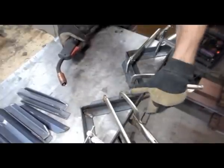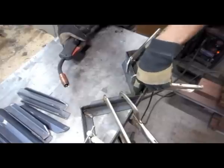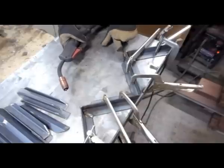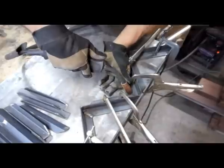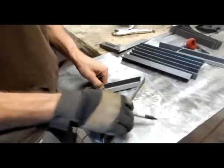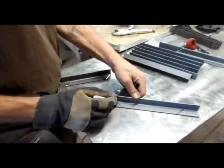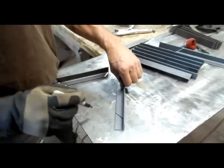I've set up a quick change-out 90-degree so I can do this one corner and then I'll have the measurement for my third leg of the shelf bracket. What I'm going to do is weld this corner and all of them. I'll end up cutting this out and cutting that out and I'll have a flush miter. Same on that side.